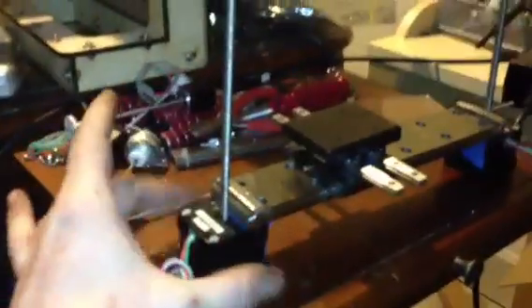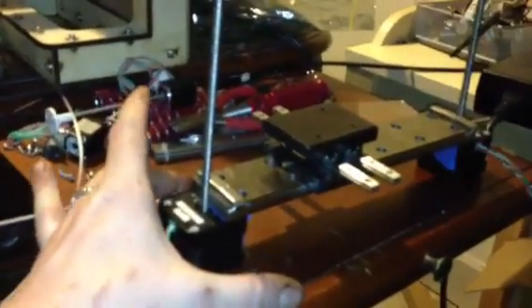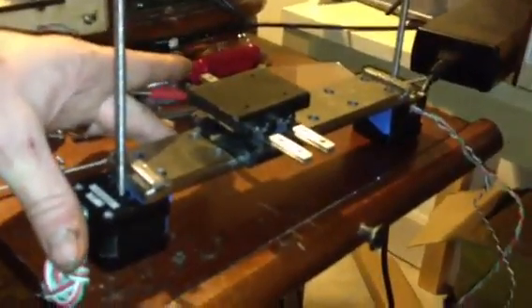This will be driven by two of these little tin can linear steppers, two NEMA 17 linear steppers, and a RAMPS board I have laying around. I'm going to have to figure out a nice small extruder for up there, but since it doesn't have to move, that should be pretty simple. This could fit in almost an iPad case. It's a little wobbly, so it's going to need some bracing — I might make T-slot pieces that go out for stability but fold under the Y gantry so the whole thing still fits in your laptop bag.